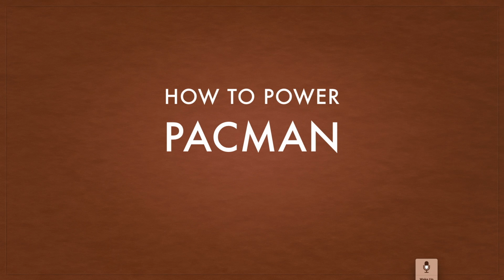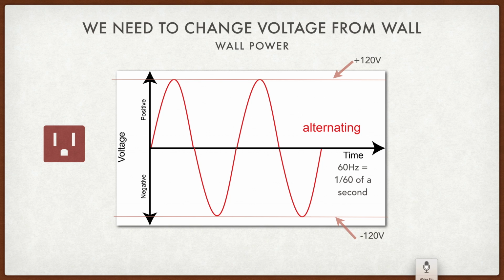This is going to start from how we get the power from the wall and turn it into something that the arcade machine uses. If you were to measure the voltage from your wall, you would see it was alternating current from 120 volts to negative 120 volts over 60 hertz. That's 1/60th of a second. That's the standard power in North America, and this is what we have to start with.